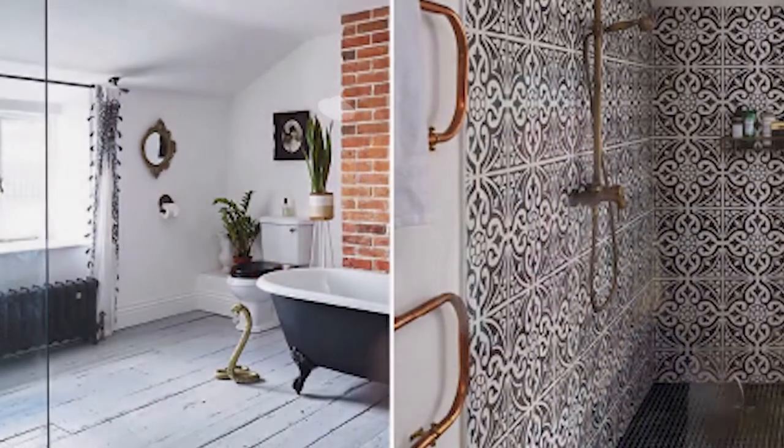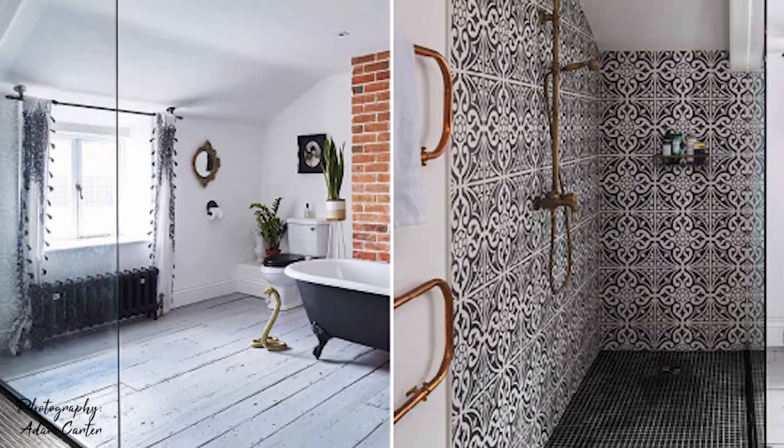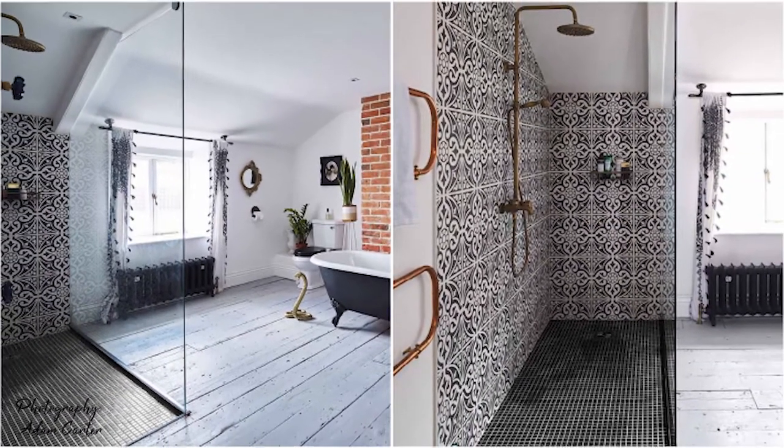Can you talk about the floor level and how important it is to get that right? The floor level is critical to what your experience will be like with your wet room. The key is that you have a fall to the drain, which can be created by either a pre-formed tray that goes underneath the floor — you tile on top and cut the tiles to suit the slope — or you can have a pre-formed tray made from resin or steel enamelled, designed to sit flush with the surrounding tiling. You get the same flush end result but without cutting tile into the tray, giving you a completely smooth surface with a pre-designed floor that flows into the waste.